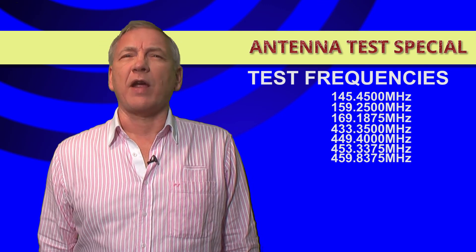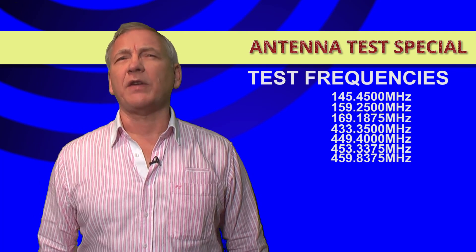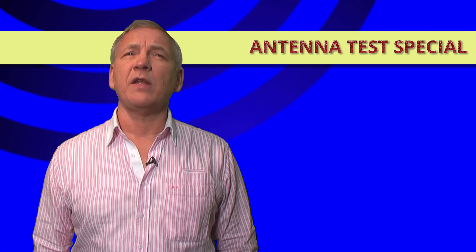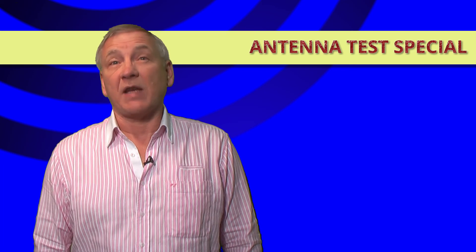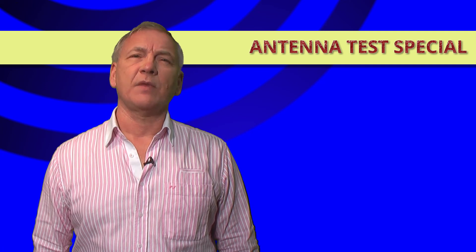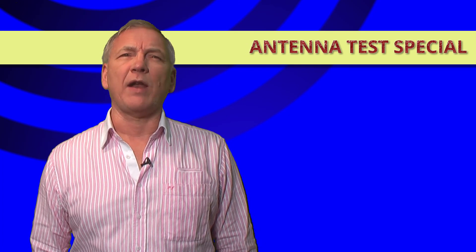In the workshop I set up a radio with a signal strength readout connected to an external antenna through a stepped attenuator. The testing regime is simple: transmit with the test antenna, then use the attenuator to produce the same signal level at the receiver input. The better the antenna performs, the more attenuation is required at the other end to produce the same input at the receiver — seven measurements for each antenna. I found out quite early on that even low power was too high, so I had to attenuate the radio output power down to around 100 milliwatts to get meaningful results.